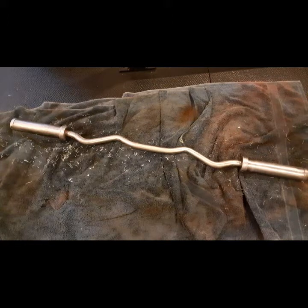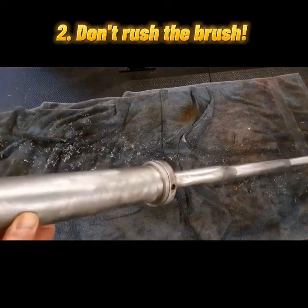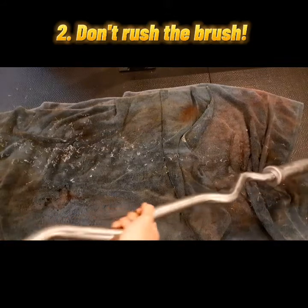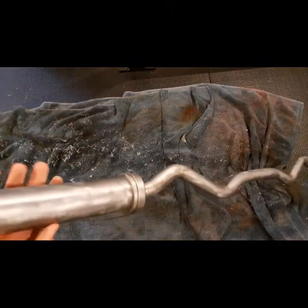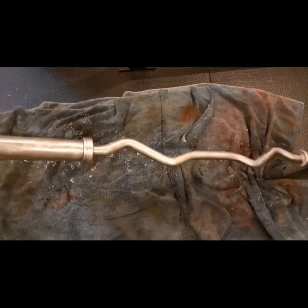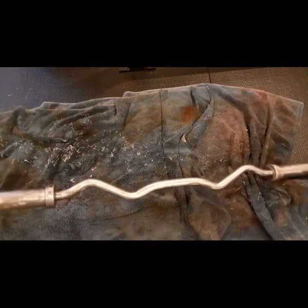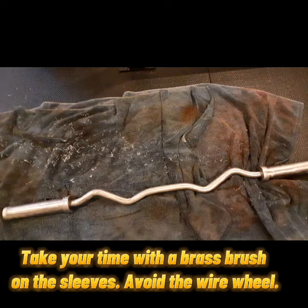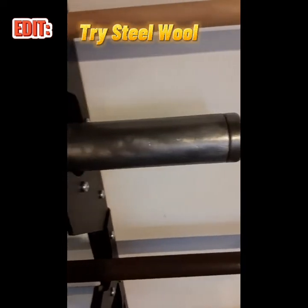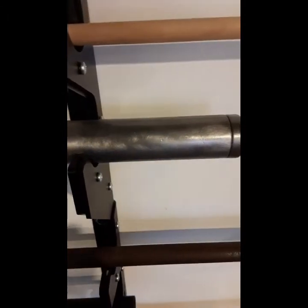The second thing I would have done differently: the wire wheel. I got a little lazy and the wire wheel left markings on the sleeve. The bar itself didn't pick up that many markings, but the sleeves — goodness gracious — it looks cross-hatched. Since this is going into my own personal collection, I'm okay with that. But is it a blemish that should be avoided? Yeah, probably. So next time I'd take my time, not use the wire wheel, let vinegar do its job, maybe soak it longer. I found others in the same situation and some had luck using steel wool to remove the scratches.